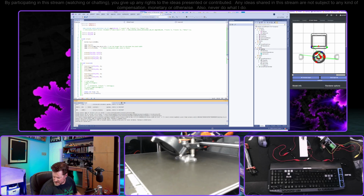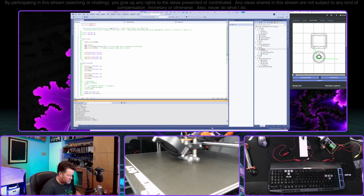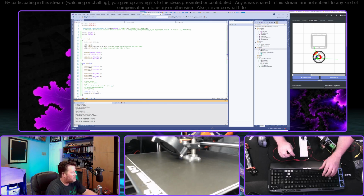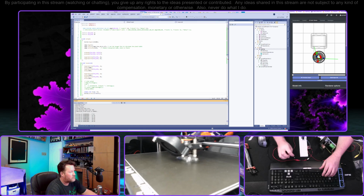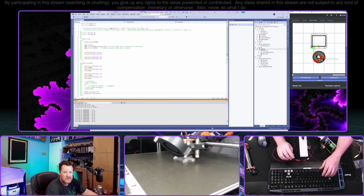Nice thing is that with this setup, it would be pretty trivial to go ahead and set up a small PCB that's got a microcontroller on it and at least a few of these H bridges so that you could control 4, 5, 6 pop bumpers all at the same time off of the same MCU.